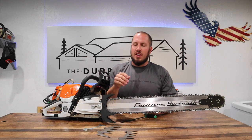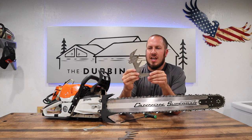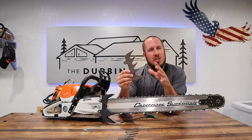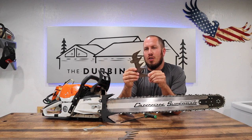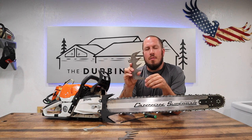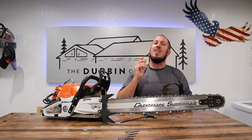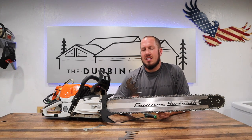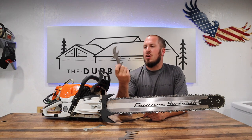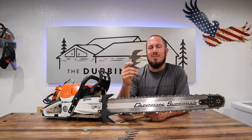So if you're usually into felling dogs and you're looking at sets, you have the offerings from Piltz. Piltz has an awesome five-spike felling dog, but it really doesn't make any sense. I've run this felling dog for a long time, and I really just wish there was more here. The spikes are all the same length except for the bottom one, which is extremely long, and I find myself not even using that spike. A lot of times that spike is just out there taking almost an extra inch off your bar. It's aggressive, it looks cool, but it's not functional in pretty much every way.